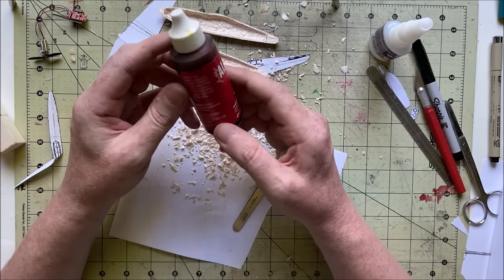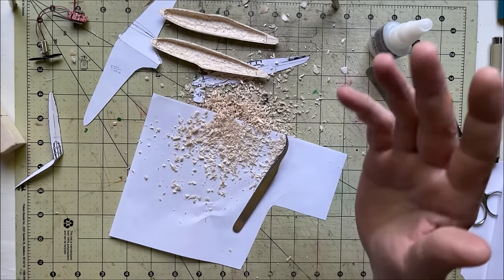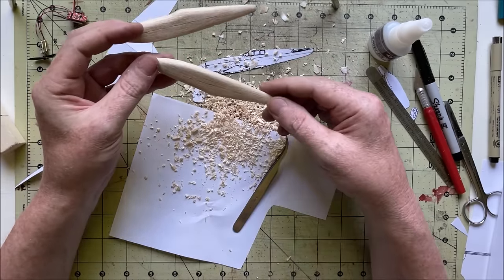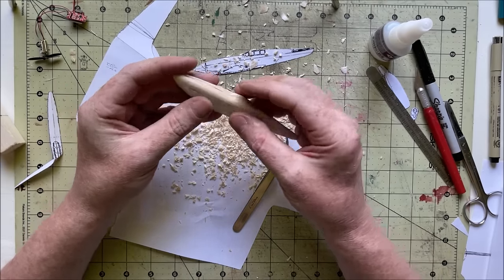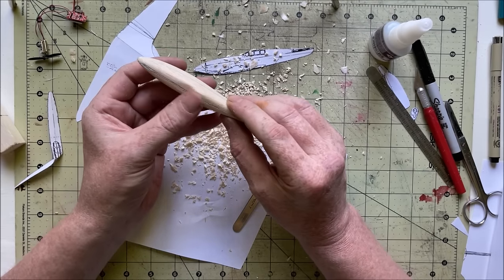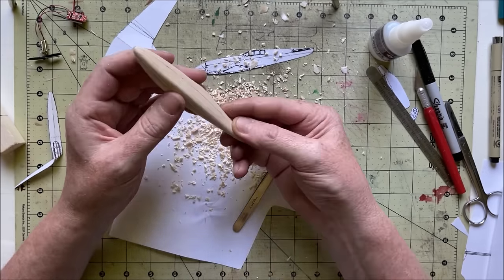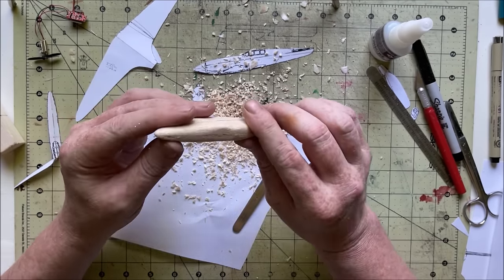The material that I want to use to color this with is this stuff right here, alcohol ink. It's a pigment in an alcohol solution. The alcohol evaporates and the pigment stays where it is. And it should be much lighter than spray paint, because spray paint is actually pretty heavy for what it is. And unfortunately, it's very transparent, so any outside blemishes or lines are gonna show up really, really well. Usually, when I make one like this, I'll add just a little bit of really lightweight spackle filler and sand everything down and then give it a coat of paint, and it hides all the mistakes really well. I'm probably not going to be able to get away with it on this one.